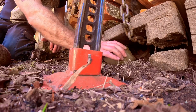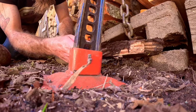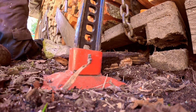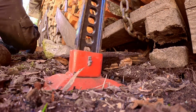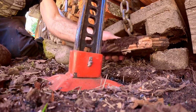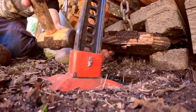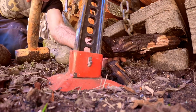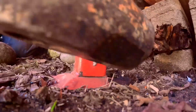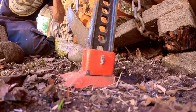All right, so hope you can see this okay. I got some more blocks here. I got this done as 2x4. I'm not sure if that will fit in there. Let me see if I can go a little higher with this jack. Okay, does that help us? I'm almost there. Take a sledgehammer, try to knock that in. Here we go. Just a shim. Not ideal, but it should work. Okay, so that's there.